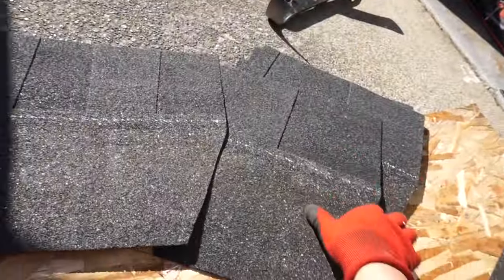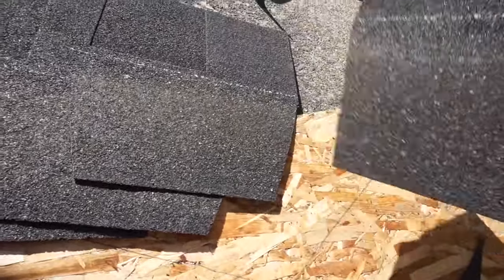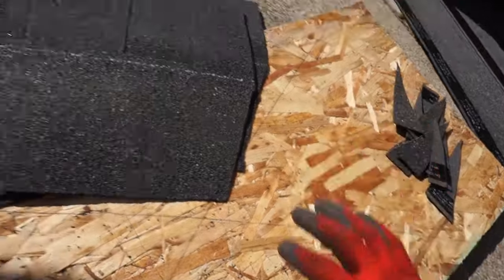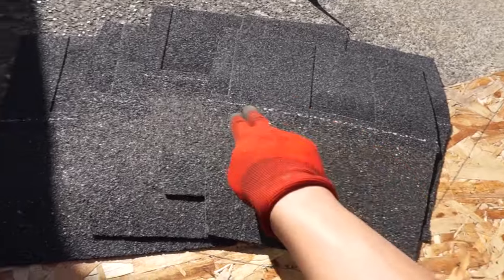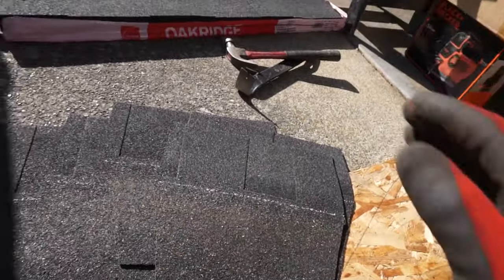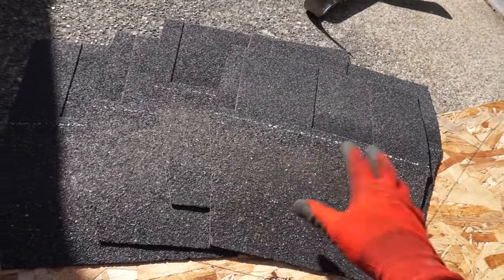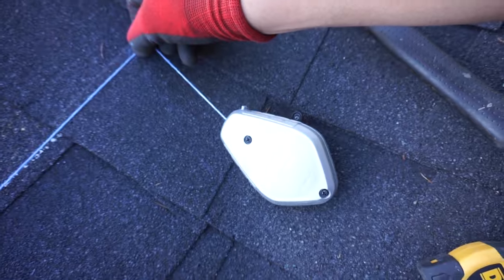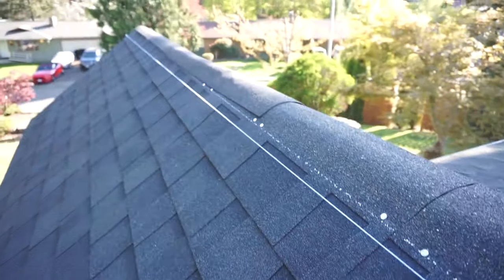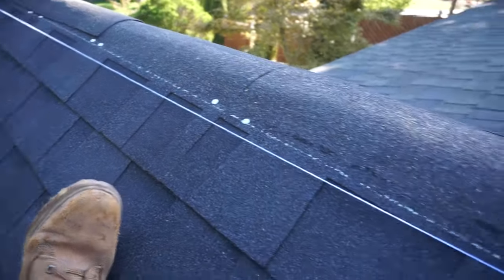There you have it — I made a couple of sheets, all 13 inches in length. Here are all the scraps — throw those away. Now I'm going to go up on the roof and show you how to do the first placement, how to nail it properly on each side, and how to end the cap once you reach the very end. Make sure you use chalk and snap a chalk line across the ridge so you know each piece is placed perfectly straight.